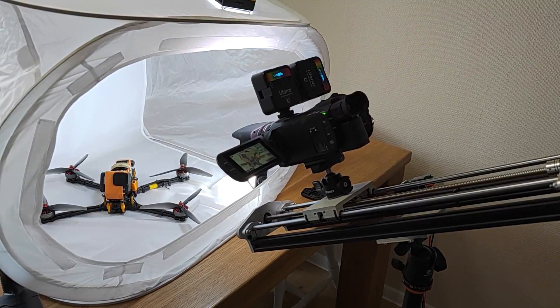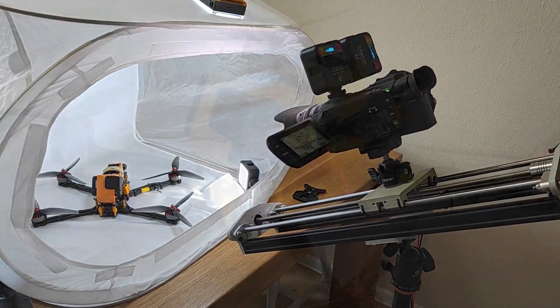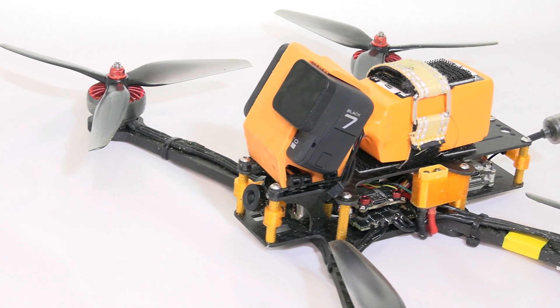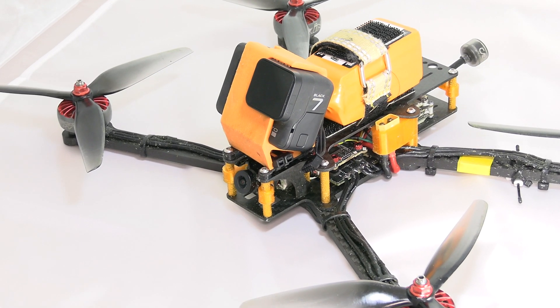The results — I have to say on one hand are kind of promising, because yes, it allows you to add some dynamics into previously static shots, which is great for recording b-rolls of a product, or for adding dynamics to shots of your face, with regulated speed so you have control over what's happening. With the addition of the second stepper motor and pan capability, this would be even better. The options are almost unlimited, and because of that I decided that the electronics and the code driving the whole system on the ESP32 using Arduino is open source. I do most of my stuff open source, so if you would like to build yourself a camera slider like mine, you're free to do so — it's absolutely free.